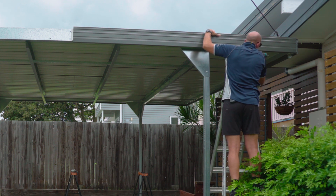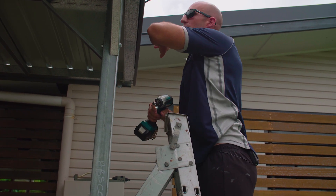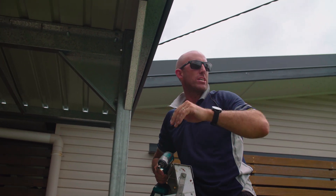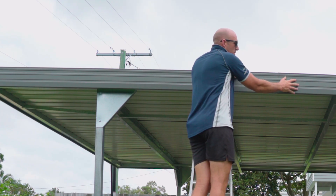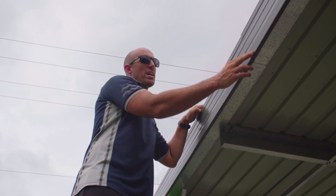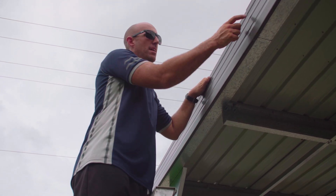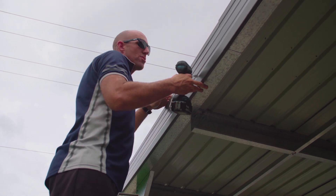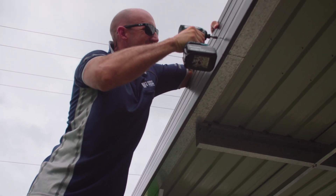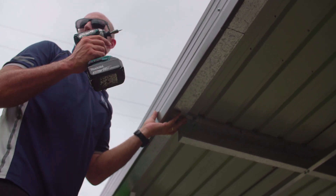Once you're happy where you've got that in place, screw it in there. Then get our other piece, put that up, and we can join the two together. We've got our first one up, now we've put our second one up. Just slide this fascia inside the other one - simply cut a little notch out and squash up the bottom, that enables it to slide into place. Once we've got that in, hook it over the jam on the other side and just put one screw through the middle. That joins those together, and then screw on the end - that's locked our fascia all in place.